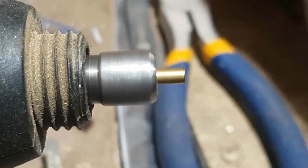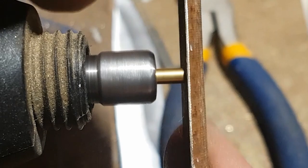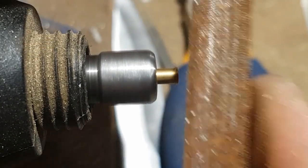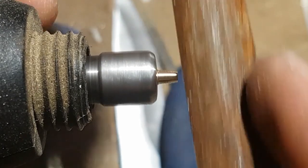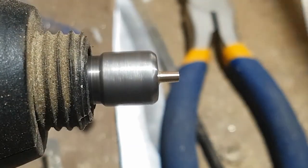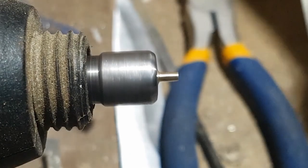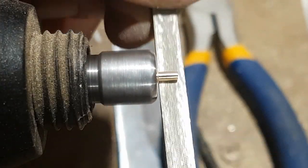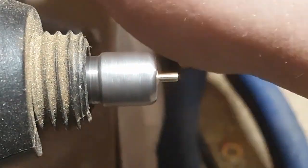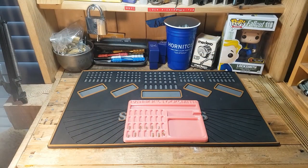I'm going to measure the height of my pin so I know where to sand it down — you want these to be basically flush once done. I take the large file and file it down, then stop to check the fit. If you file down too much material it won't be snug; you want it loose but not too loose. Switching to a smaller file to take off less material, I refine the T-pin until it fits perfectly — flush on top and moves in and out easily. That's basically all it is for the pin-in-pin.